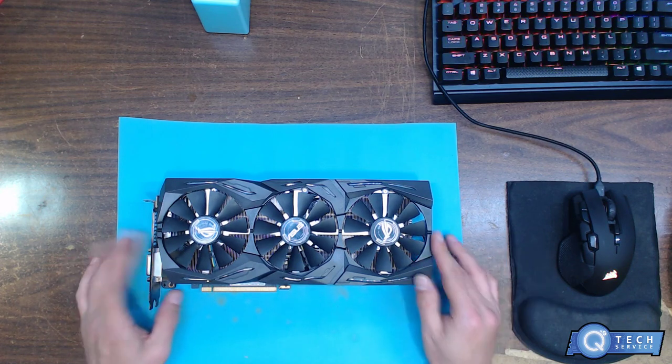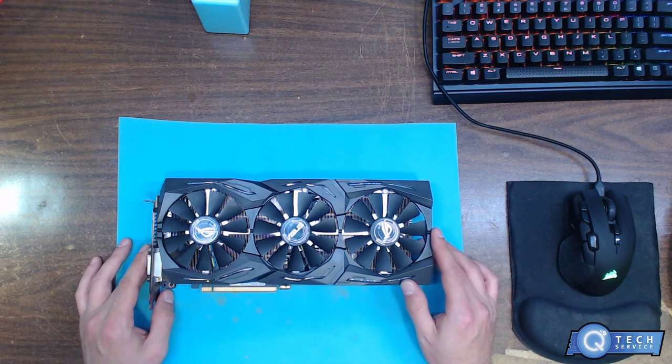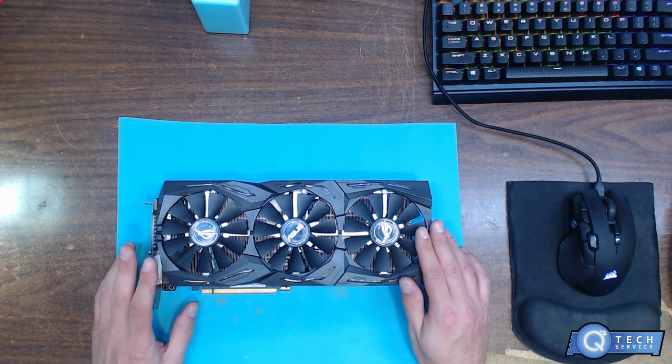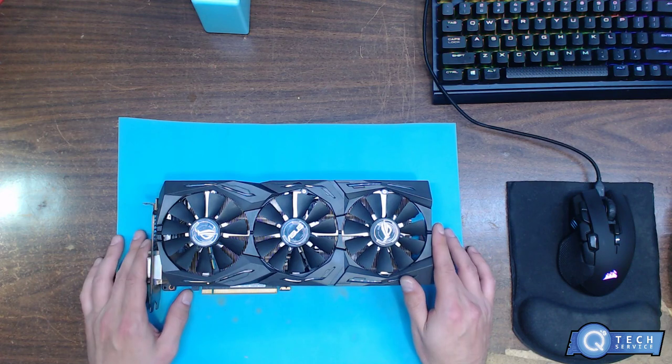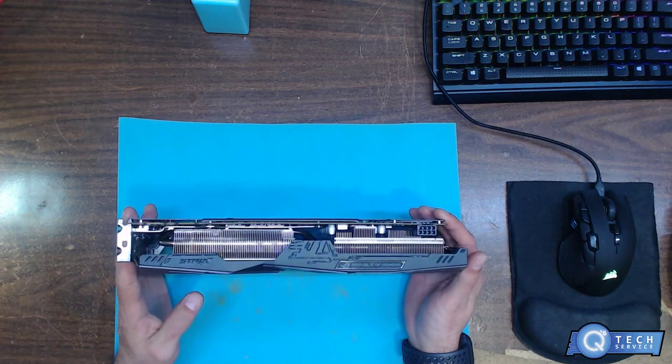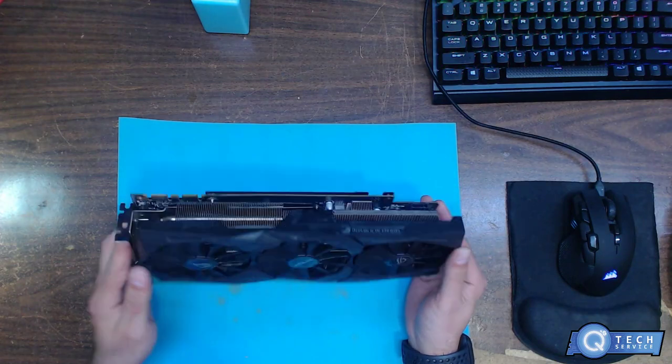What I don't like about the liquid metal, as I'm always saying, is that if it does drip down on any type of components, it does damage anything that is powered. We'll be able to see when we take it apart if anything dripped. It ran for a couple months after the liquid metal. Have you had this sideways in a computer like this all the time? Yep.